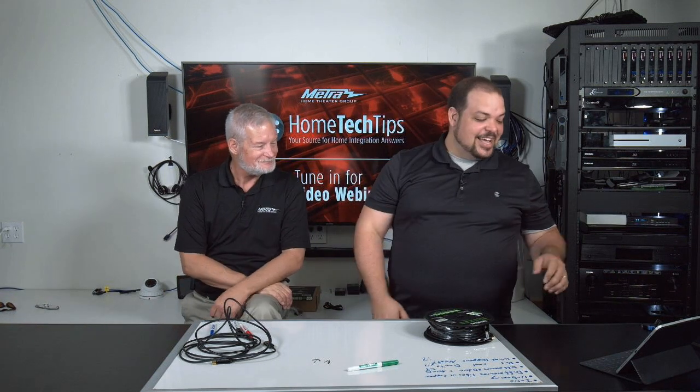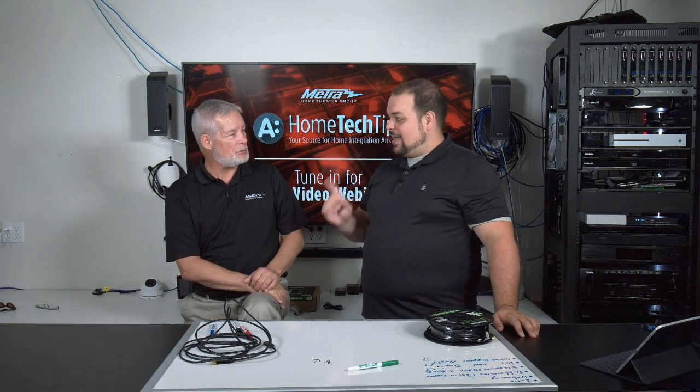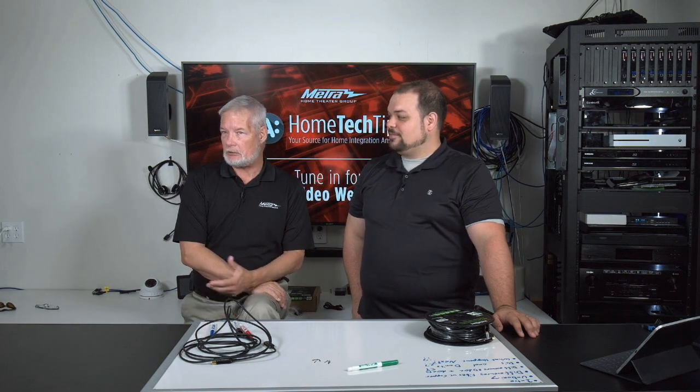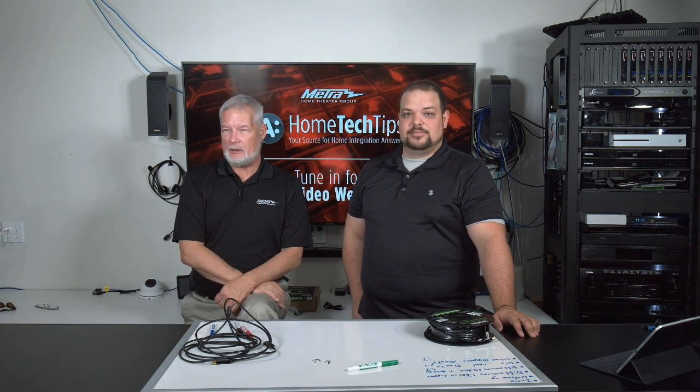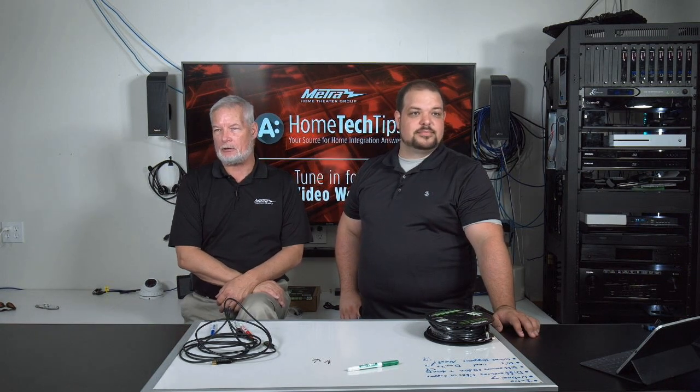Yeah, exactly. So do the cables come in plenum or outdoor direct burial? Plenum, yes. Direct burial, not yet. However, if enough of you need it, please let us know. In the meantime, lay down your conduit. That's a great way to do it. The detachable headshell pulls very easily through conduit, and I haven't seen any issues with guys running into water, humidity, or vapor problems with the actual jacketing. Yeah, Brent, I have not. And I would be a tad bit concerned with direct burial with the yard guys.